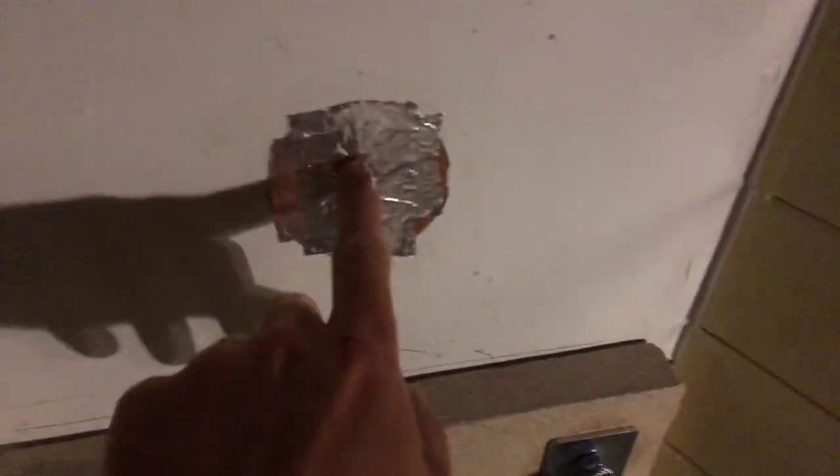And then this is a gather hood, which has a jubilee clip and some steel wire, just to ensure that if there's any movement from the heat and it drops down, this wire will catch it and stop it from falling onto the kiln while we have a chance to reassemble it. There was a slight leak from this one here, and it's because these bolts weren't in very tight, but they're certainly supportive.